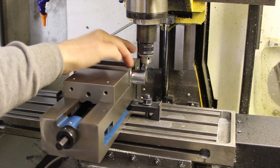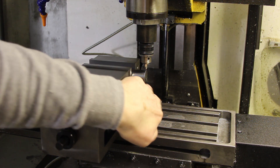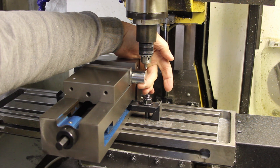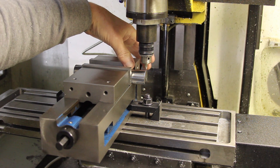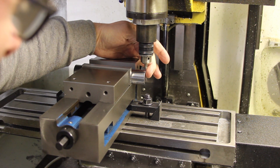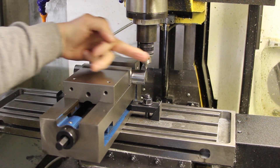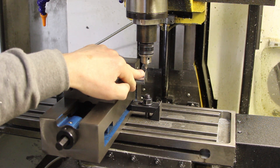Here's the setup for drilling the holes. The bar is upside down, so we're resting on the machined corners of the piece. I've just put a drill chuck in the quill and we've lined up roughly with the end. This doesn't have to be that precise - it has to be in the middle, but not that precise in the X-axis. So I'll put the wiggler in and find the centre of the bar.